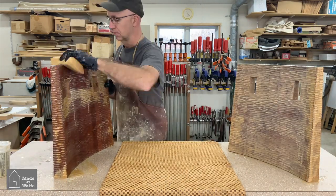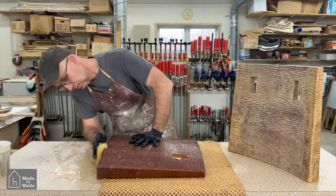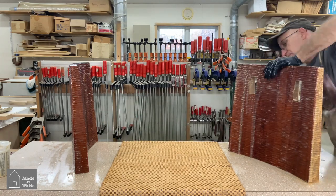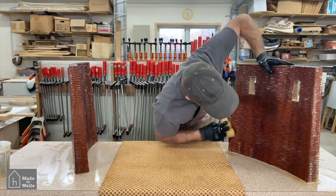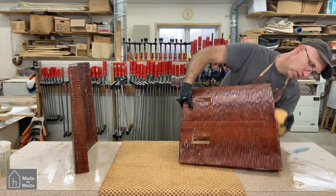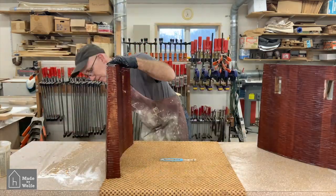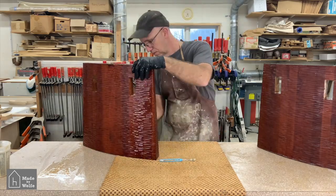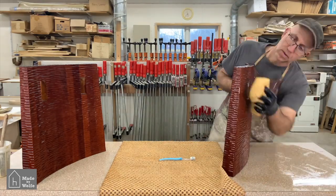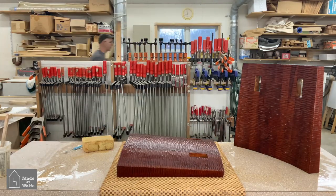After leaving it to sit for about 10 minutes, I went back over it with a sponge and water. This process took a while — I had to go over it about four times, switching out the water close to six times to make sure I was cleaning with clean water, wringing out the sponge continuously and wiping repeatedly. I was also able to use a toothbrush to get into the cracks and crevices created by the chip carving. There was a little bit of tear-out where milk paint had settled in, but the toothbrush got that out fairly well. After everything was cleaned up I let it sit for a couple of days before putting the top coat on.